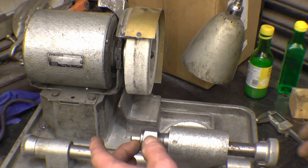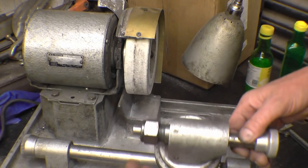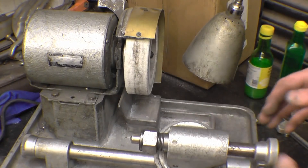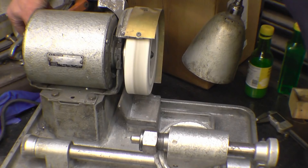I've found one of the best collets and I've put a diamond dresser in there. I'm just going to dress this stone up and then actually have a go at sharpening the drill. The stone's in a bit of a mess but I'm sure it will clean up. It'll be a little bit noisy because the motor is very noisy on the grinder.